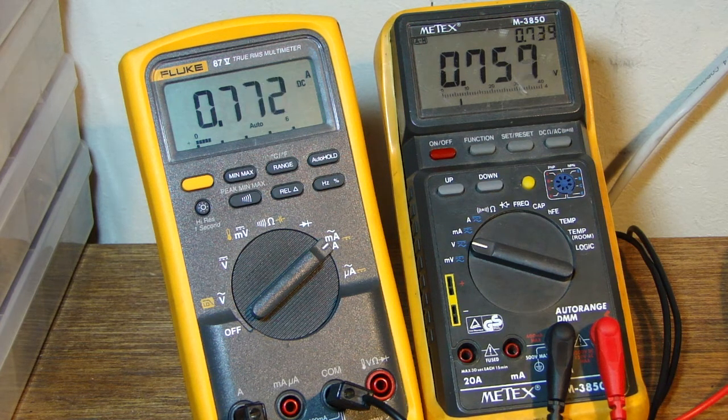If I was doing current loop and stuff like that, I could get quite good precise control. If I reduce the PWM voltage, the resolution gets higher because the steps per volt is much lower. I could limit to 1 volt output rather than the 2.5 volt output, and then for the number of steps that I have, I get a bit more resolution. As it stands I think it's pretty good — I could probably make it switchable so that you can change the upper limit.